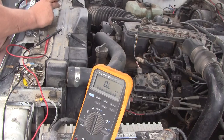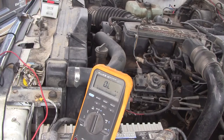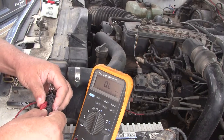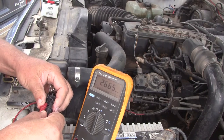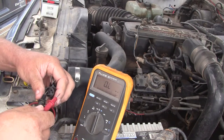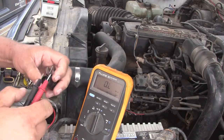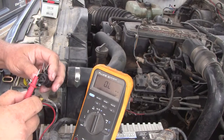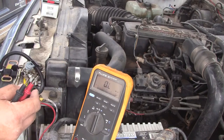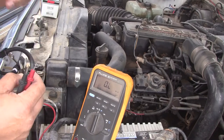I went and got a new part at the store, and while I was there — before I ever paid for it — I took this exact meter and did the exact same test on it, right on the desk. It read 2.6 megaohms this way. Flip it over and you get absolutely nothing. So essentially it's a diode across these two pins — it could be a transistor junction or whatever, but it acts like a diode.